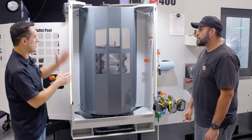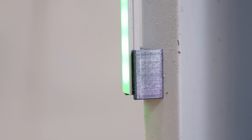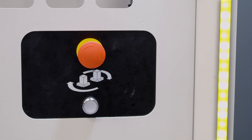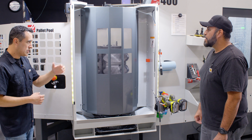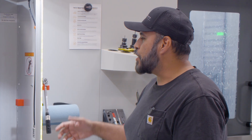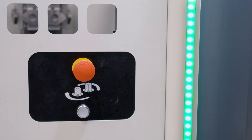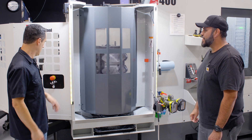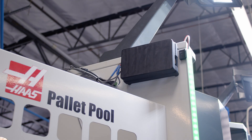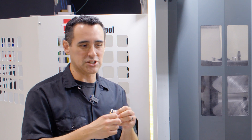The workflow is you look down — if you're looking this way you see this one, you're looking down the other way you see that one. We went with 3D printed magnets, so it's super user-friendly; it just snaps right on. Carlos cooked up a circuit board that actually monitors this light — if it sees it flashing, it interprets that as needing to turn this yellow. When you change parts and press the button, it turns white as it's moving, and once it drops it off and it's scheduled, it turns green to let the operator know the parts are ready. Green is money — everything's good. Carlos took it a step further: this whole circuit has its own independent power source and it's opto-isolated, so it actually looks at the voltage through an optical decoupler with no voltage exchange. It's good engineering.